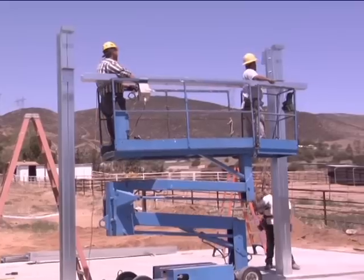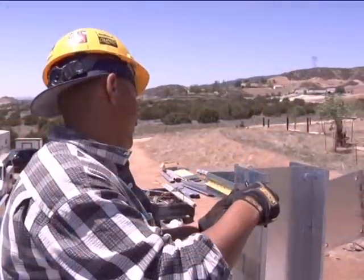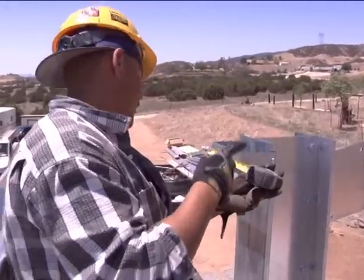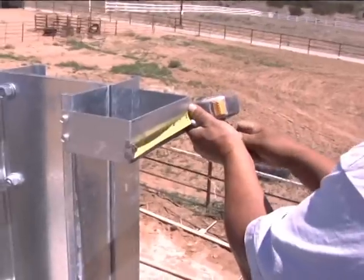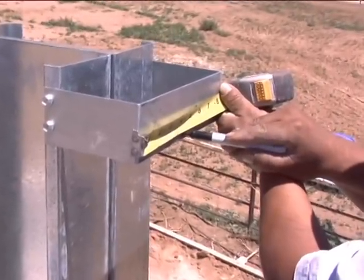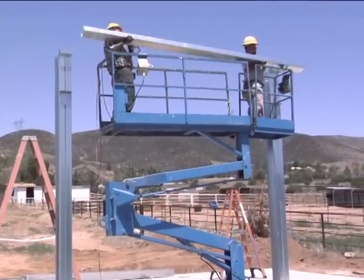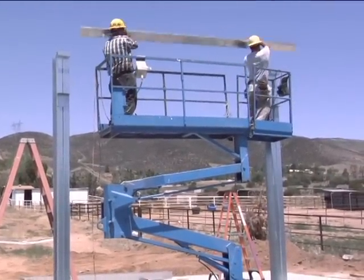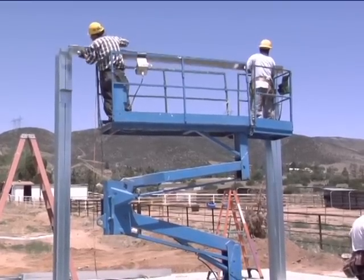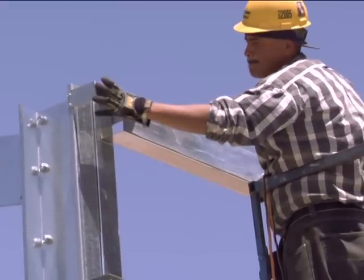This type of lift is recommended as it aids in job site safety as well as speed of installation. It will help to make center marks on your eave purlin brackets in order to make any adjustments necessary to ensure that both columns remain parallel and plumb. In this bay, the columns were placed exactly as called for on the engineering plans, so the edges of the eave purlin will line up with the center marks made on the eave purlin brackets, ensuring that both columns will be parallel.